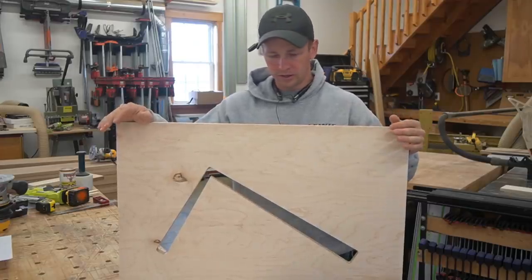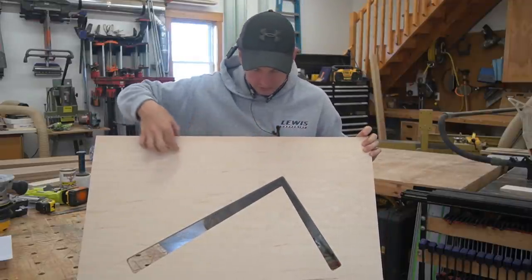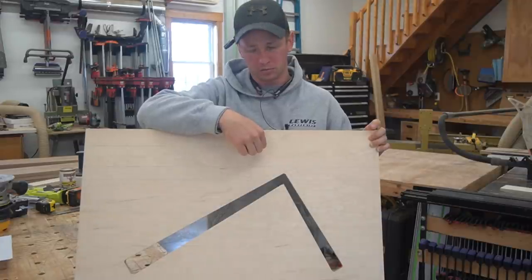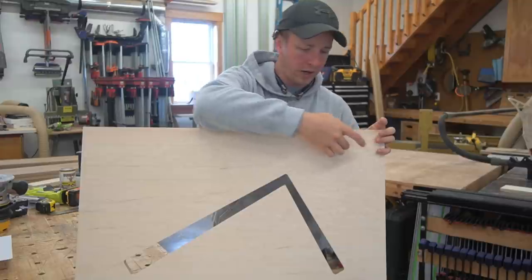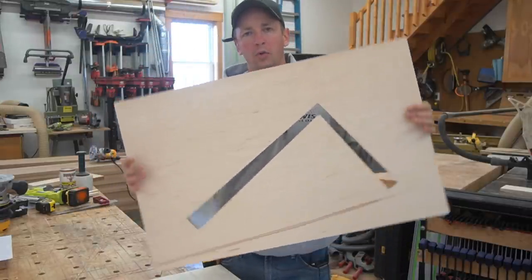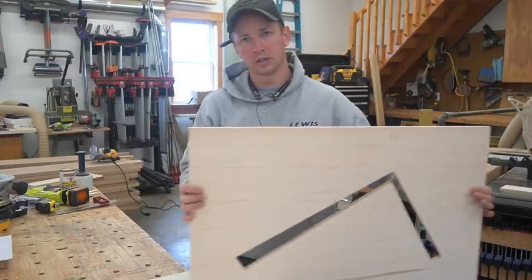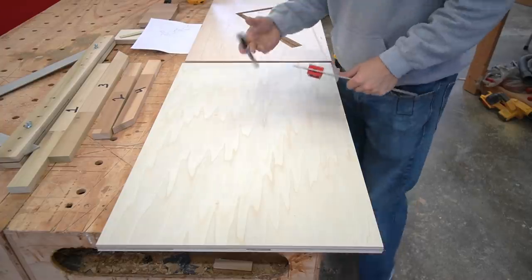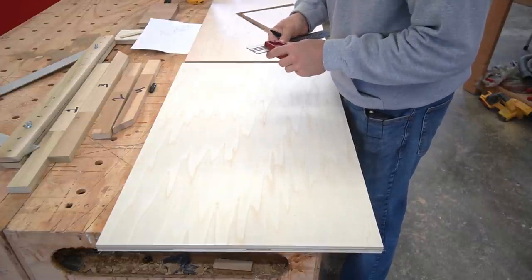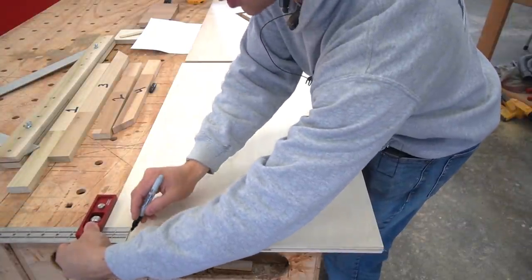An important note on the size of the template: the way I marked this out, I drew a couple parallel lines with the top edge here. There's a two-inch space here, and then there's another two sets of lines. This line represents the top of my one-by-twelve skirt board. The reason I left two inches above is that way I can screw a piece of guide onto here, and that will help me as I go along marking out my skirt board — I won't have to find the exact angle pivoting this all the time. It'll have a two-inch guide that I can just slide up and down the skirt board. So I'm going to lay this out in permanent marker so you guys can see it. The first thing I'm going to do is move my double square to two inches and mark that top two-inch overhang, which gives me a little space to screw a guide onto.